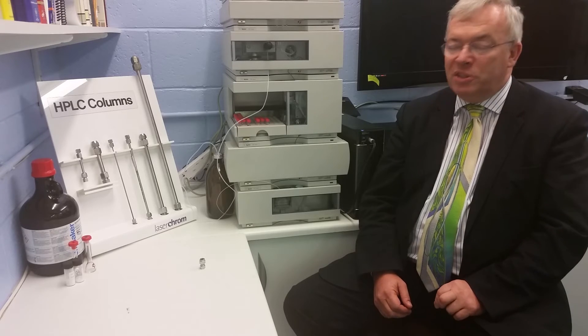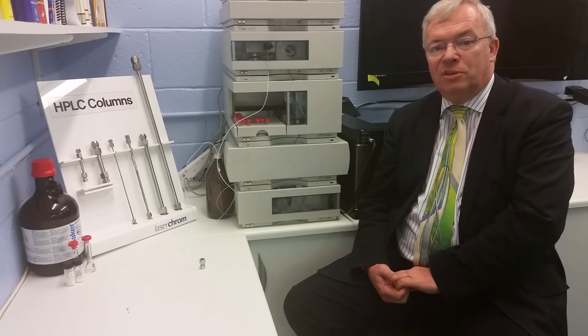The first thing to check would be to disconnect the tubing from the bottom of the column. We're not expecting any change in the pressure, because there should be no pressure through the tubing into the detector and out to waste — there's no resistance to flow. But we should disconnect it and then test to see. If we then disconnect the tubing from the top of the column, we are going to lose 200 bars, because that is the normal back pressure from the column. So if the pressure now goes to zero, the problem that caused the extra 100 bars must be in the column. If, on the other hand, the pressure remains at about 100 bars, then something else is blocking up.